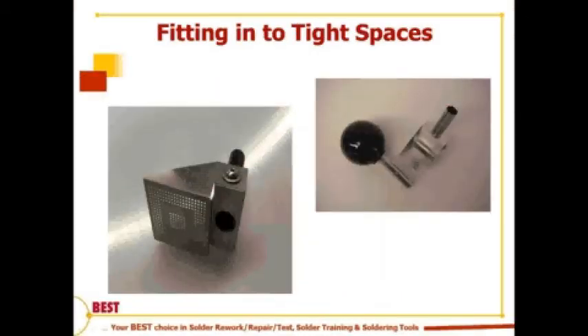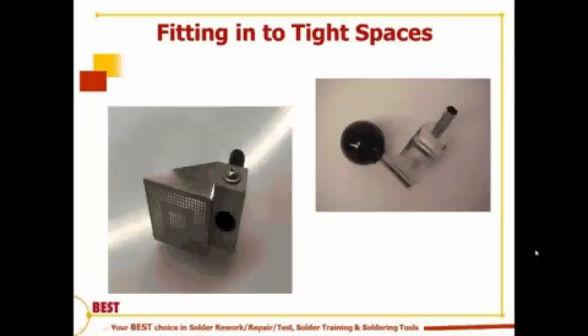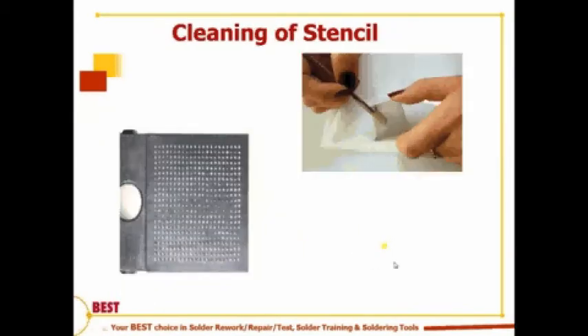Because the stencil is thin, we need some mechanical means to hold it in place. One approach provides a little rocker area where we can tilt the stencil back and rock it away from position once it's been printed. Or we can use a handle system. There are many variances on these themes — these are just some examples — but they all present potential problems.